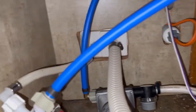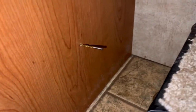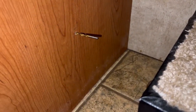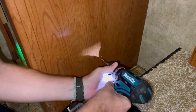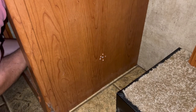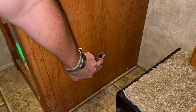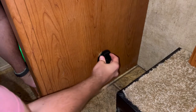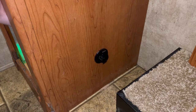Since I don't have a hole saw — which would take just a couple of seconds — I'm going to use the drill bit to make a circle of holes and then punch out the sections between them. I actually found I can use a wood spade bit for this one. It's a rough hole saw method, but the wall is very thin wood which makes it easier. Once you do a little finessing, the fitting will sit right in there with a nice fit and finish.